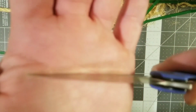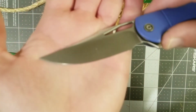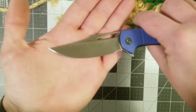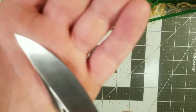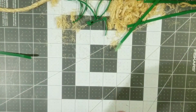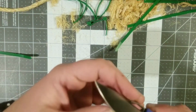The zip ties I cut with the factory edge actually caused some deformation at the edge and some reflection back to me in the light, where that didn't happen during this test. So again, more proof that after you sharpen a knife a couple times, it holds up a lot better for whatever reason. Just fatigue or burnt edge from the factory.